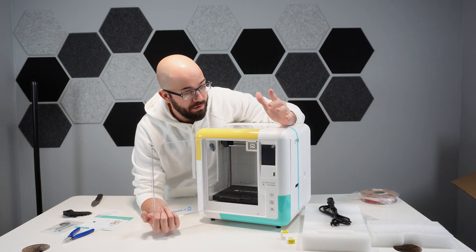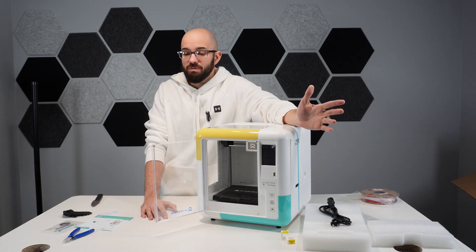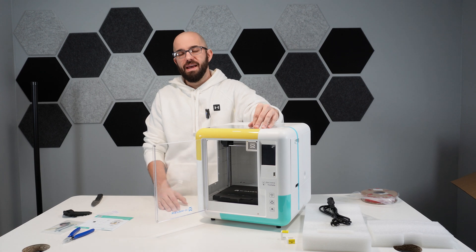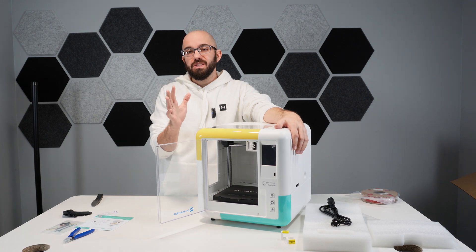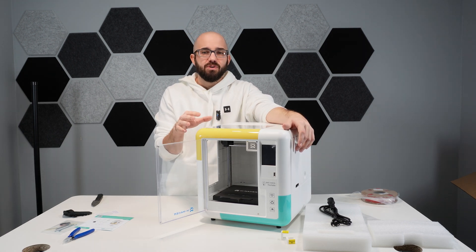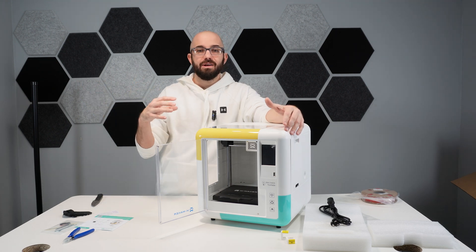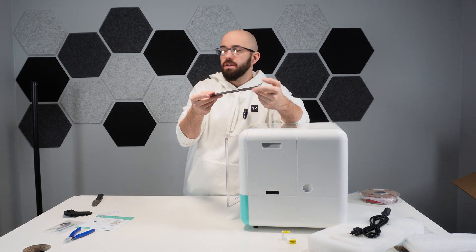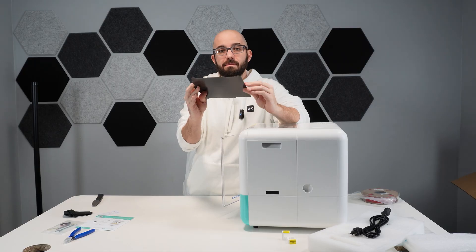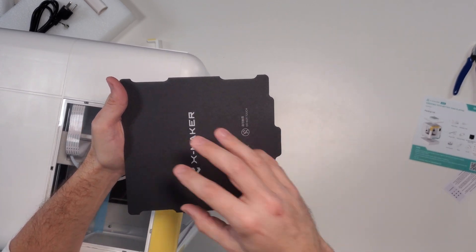Now we have our first good look at the print bed. It's not a huge print bed, but that's not really the point — this is a great way to get kids involved with 3D printing at a very reasonable price. A really cool thing with this printer is the entire print bed is enclosed. Most useful thing about an enclosed print bed is that it keeps temperatures from fluctuating. On an open bed printer, wind or cold or hot air can really affect how the print comes out. This is a heated magnetic metal print bed — the design helps with adhesion so your print doesn't move around. When you're done, you can pull the bed out, bend it, and it'll usually pop the prints free.